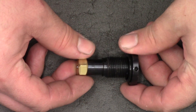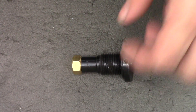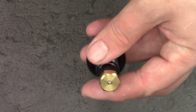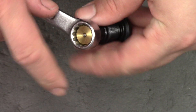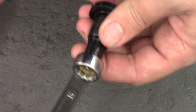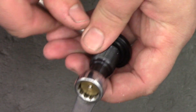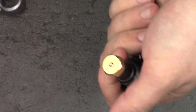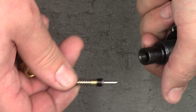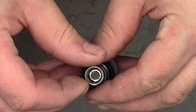And there we have the valve. Now that the bottle valve is out, we can start disassembling it further. So what we do is take this nut off the end, and that's done using a 14mm spanner. Now these can be quite tight so you might have to grip the outside of the bottle valve in the vice, or use your pin spanner in here. I've made up a little tool that just pushes in there and allows us to undo it. There's the nut, there's our one-way valve.